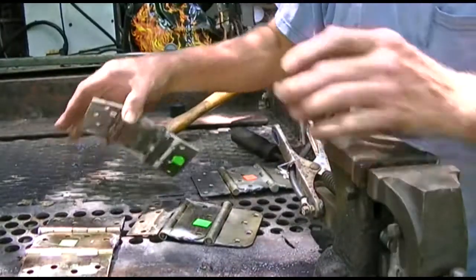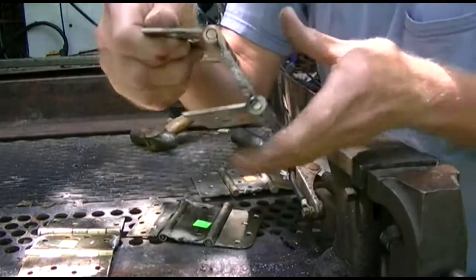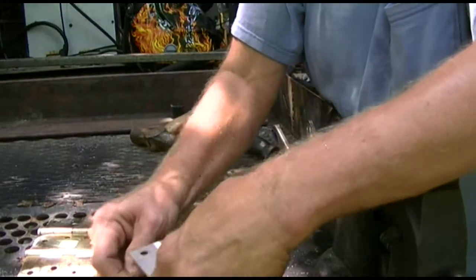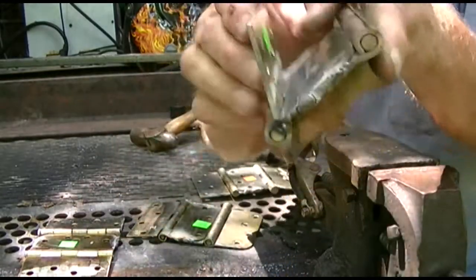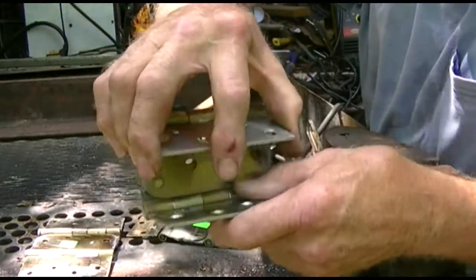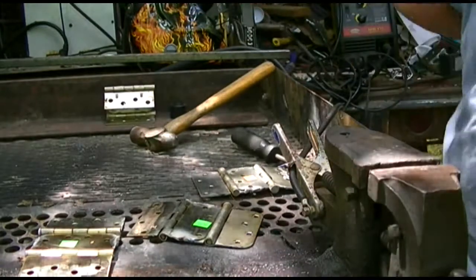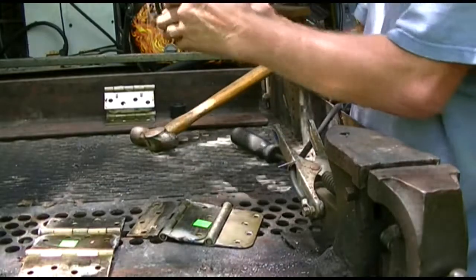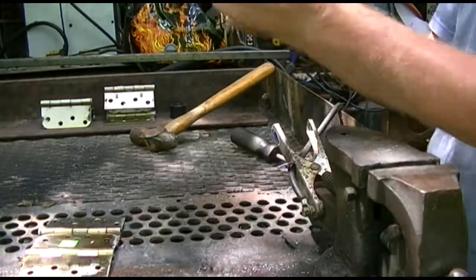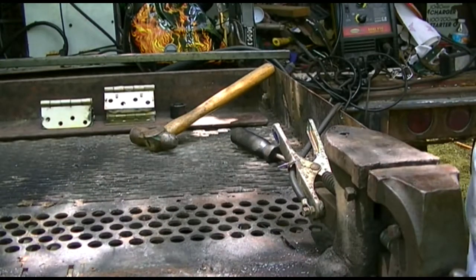One thing you're going to notice is that since the hinges are opposite each other, there's one direction this won't work — they both have to flip over and go this direction in order for this to work, and these two move up and down together. Make sure that your hinges when you put them on your finished product don't have a spot that's going to get you in trouble. It'll go up but it won't go down any more than that. We put that one on top in the back because when it's down it's already hitting the table, and that's far enough down.